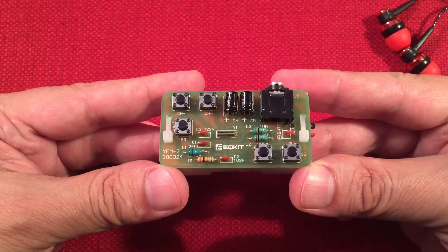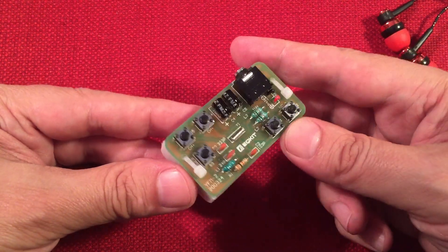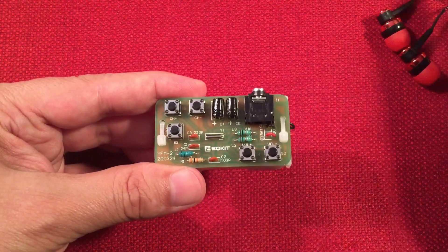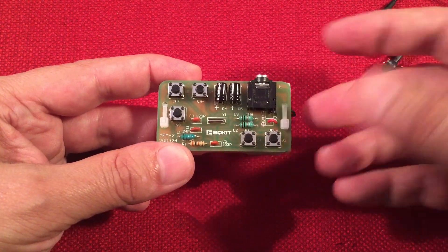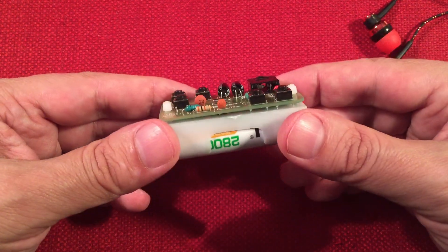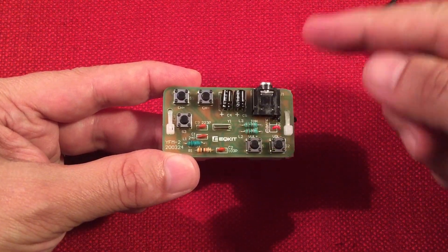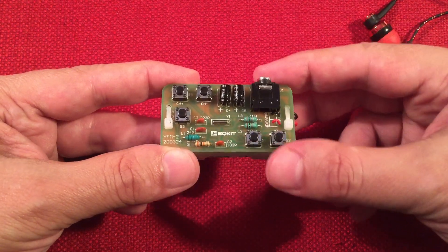Overall impressions: this is the IC Station GY18043. Like I said, say that five times fast. For $6.50, definitely worth a pickup — links below. I am an affiliate on IC Station, so if you buy one or a couple to give as gifts, I get a little credit — like three or four percent, same as Amazon. I can use it to buy more kits to show you on the channel, mainly radio kits. This is a great, easy to build kit. The hardest part for some people will be the IC on the back. Just use that tack and drag method — tack corners to make sure the chip doesn't move, put some extra paste flux or liquid flux down, take your iron with a little bit of solder, and run it down in a nice smooth motion on those IC legs.